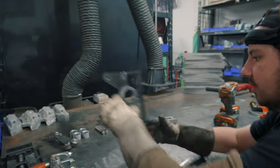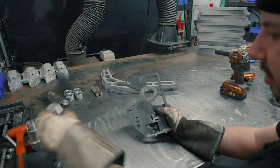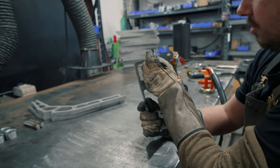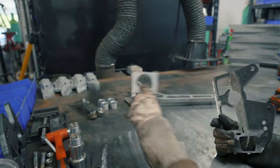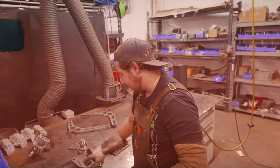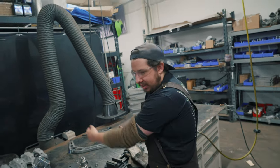We're also going to our new knuckle design — the one-piece knuckle with a spindle. It's got the shock mount on the back with a billet collar, so the shock will get sandwiched in this collar. I've already pre-threaded the bump stop holes on the knuckle and on our lowers. Pretty trick piece of equipment.